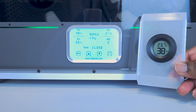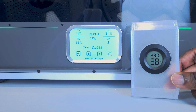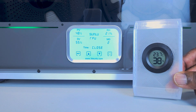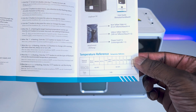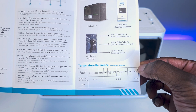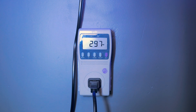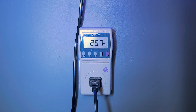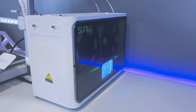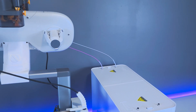While drying the wet filament, I took the opportunity to compare internal and external measurements using a hygrometer. We could see that the S4 is operating as intended and keeping our filament at optimal conditions. The included user guide provides suggested settings for a dozen different filament types that you can use as reference. The S4's power consumption is in line with what it reports, though the majority of the time it's significantly lower. When operating, the S4 does produce a bit of noise from its fans, but I don't find it too unreasonable.